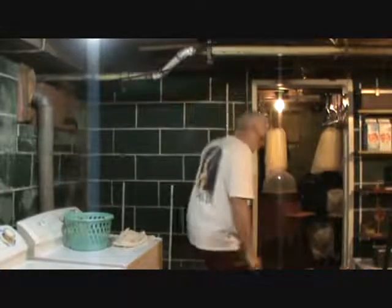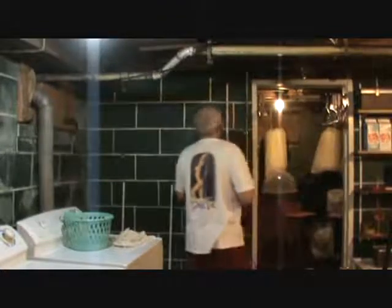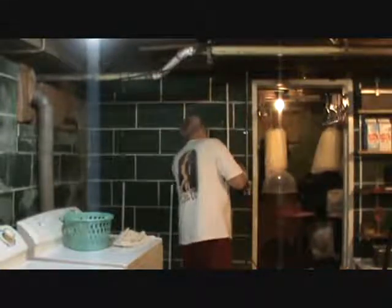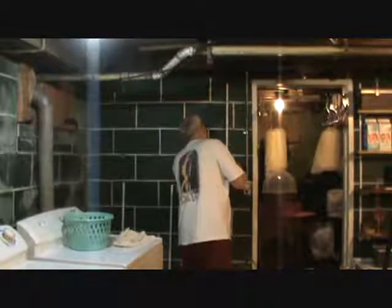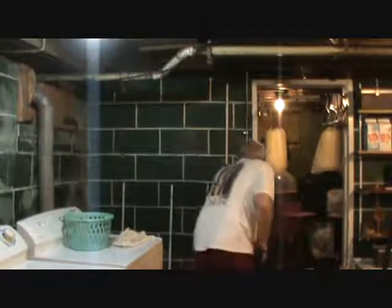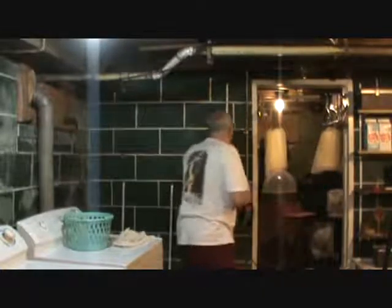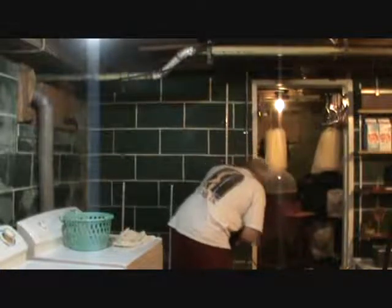Little thing I used to do, found out on aircraft: don't tighten down any screws to get them all started, because for some reason, if you got one screw tight, the others might not actually go in. So you want to have just a little bit of slack in order to manipulate it a little.